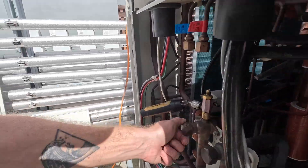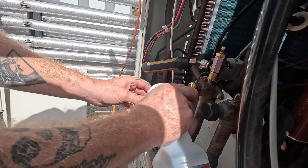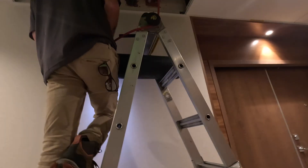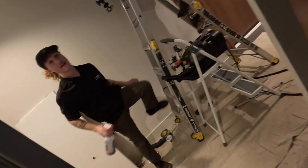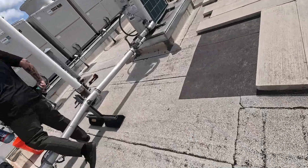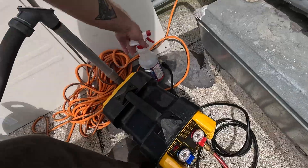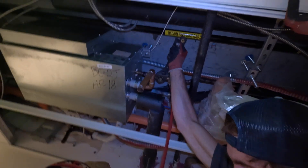We had to spray the inside. Yeah, I did — that's when I heard the bubble. Oh, you see the bubbles? The bubbles tested at the Schrader. So there's no Schrader in the tool with the T-Tool? There's no way it just randomly started leaking — this thing was holding like 200-something PSI. It's dropping pretty quick. This bottom joint on this 90 is sus as hell — like half the joint's still on there, but I got no bubbles. I feel like we would hear this if it was dropping that much. Yeah, this is where our first leak was, at that corner.